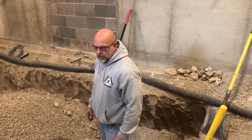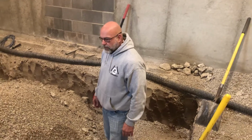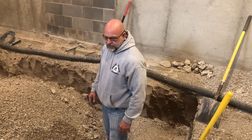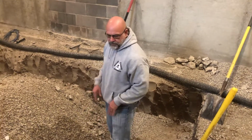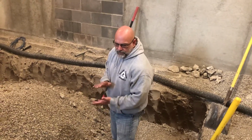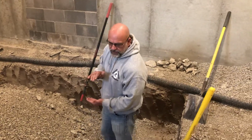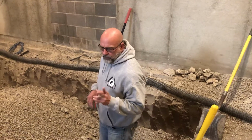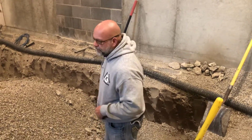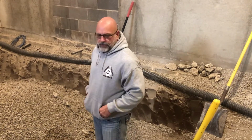We'll probably have this out before we pour the walls. So we'll pour the walls and the footing first, then come in here, spread 6 inches of this rock over here, throw some petromat over that, and concrete that 6 inches of rock with an additional 6 inches of concrete. So it'll be really 2 pours of concrete: walls and footing at the same time, monolithic, and then the floor. It's coming together pretty good.